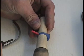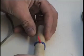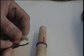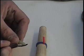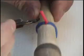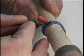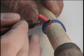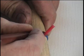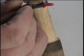Now, what I need to do now is go around the edge and attach it firmly to make sure that it's nice and even. So at this time I'm going to get a bit of sticky wax. So here we go. My sprue's a little crooked here, but I want to attach it. So first thing I'm going to do is carefully melt around. Now, I don't want to melt my project. That's what I'm trying to avoid. So I'm trying to add wax and blend it together.